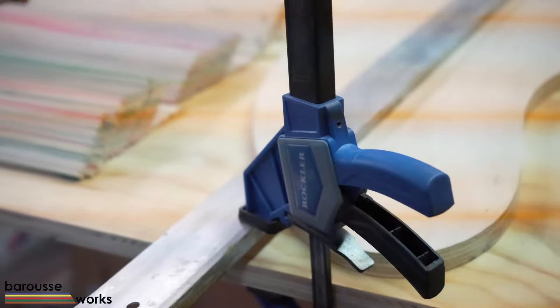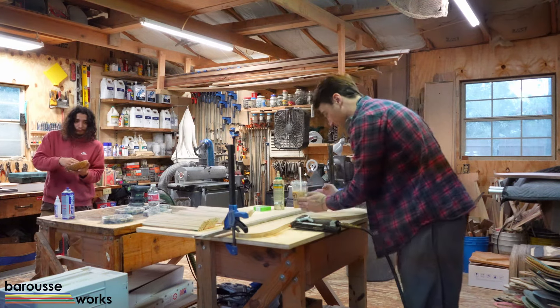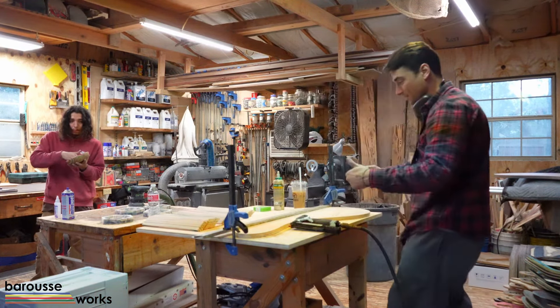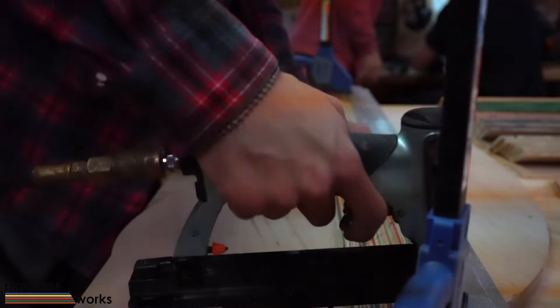What you're seeing right now is the prepped area for the glue-up process. Here you can see a table core, veneers made from skateboards, a pin nailer, glue, and a straight edge. The very first step is to form a straight line that the veneer pattern is going to follow — that's what the straight edge is for. We're going to take these veneers and lay them down in a tile pattern moving this way, then unclamp and remove the straight edge and go the other way, then flush trim the whole edge. Let's get to it.